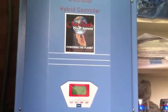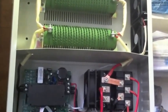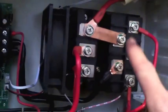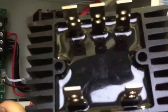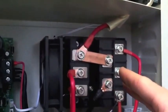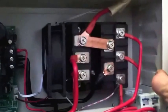So hang on a minute. Okay, I'm back. This is the inside of the controller. This is where I think the problem is. The AC goes into here from the turbines into this rectifier. And then usually this would go to the neutral of the battery, and this would go to the hot of the battery. For example, this is the rectifier that I purchased to replace that one, because it just looks a little odd to me. Like what's this bar for? So basically you're getting power going across this bar and it's going right to the diversion resistors. That's how I'm seeing it.